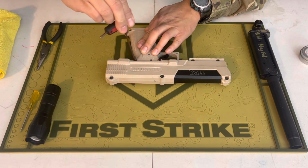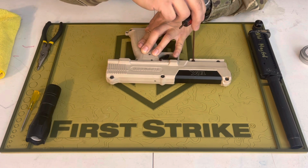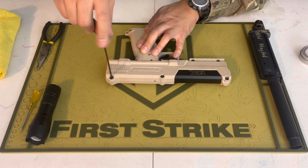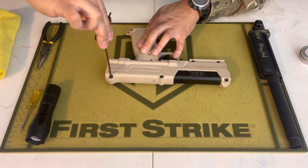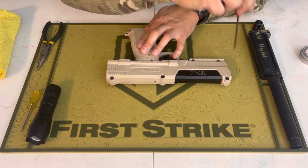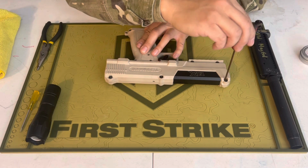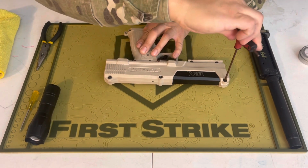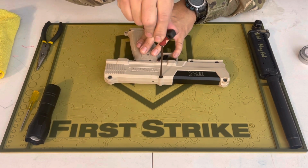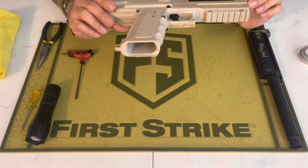And I don't over tighten it, guys. I always use the long side of the T-handle or Allen key, so that way I'm not applying too much torque to the hardware or fasteners. Once it stops and once I'm able just to apply a little bit of finger torque tightness, that's enough. Okay guys, so that's it.